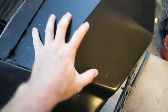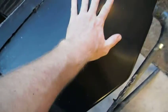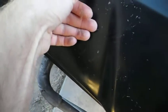These things pop out like butter — they don't stick in the mold. I used to use mold wax release and that stuff works, but the PVA is way superior for keeping it from sticking. You can see it washes off real easy — you can actually peel it. It's like having an extra layer of skin. See that? That's the PVA — it just peels right off.